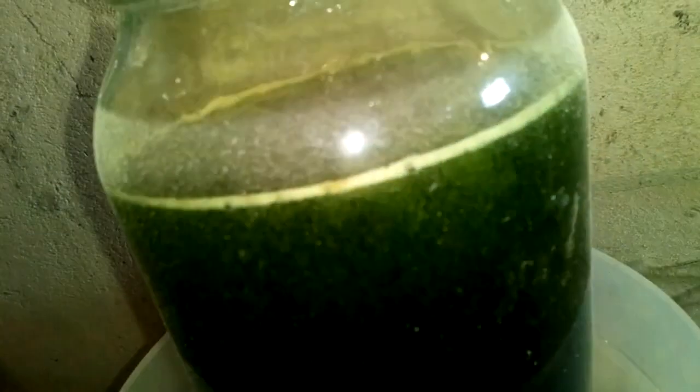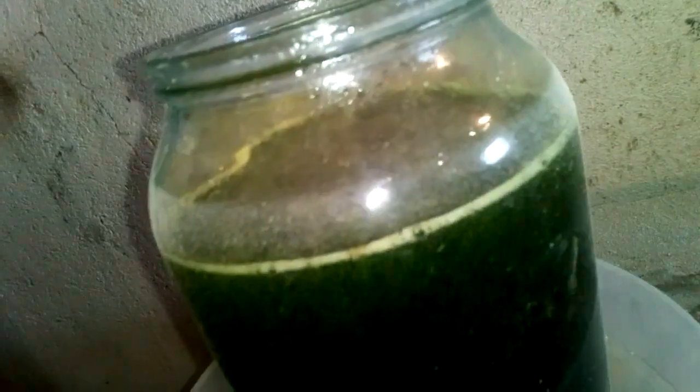Okay guys, you see this layer in the middle of the jar, this black layer is gold, but we're not good. My urea was bad, and we didn't neutralize, denox, that extra nitric, so our gold is going back into the solution. So I will just wait for the reaction to stop, and I will denox that with urea again, other urea, and drop the gold again. Crap.